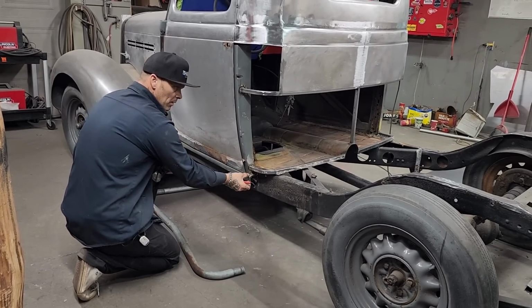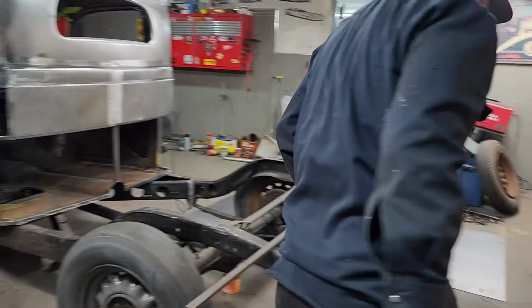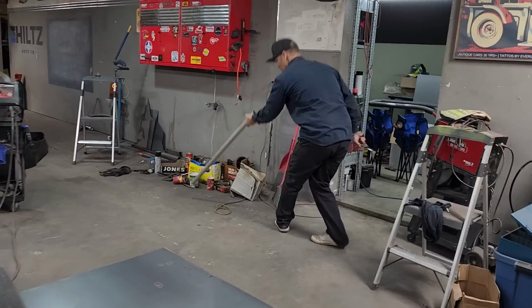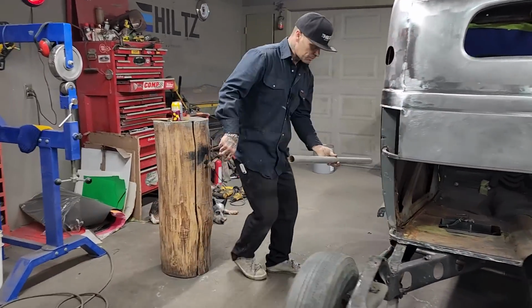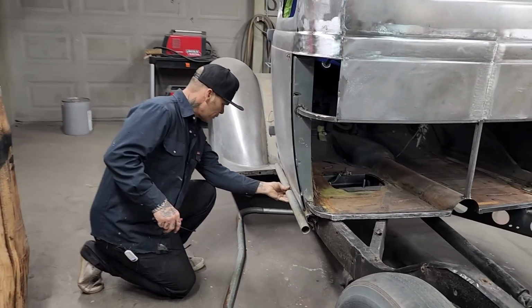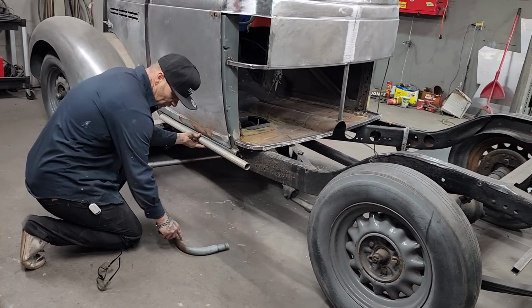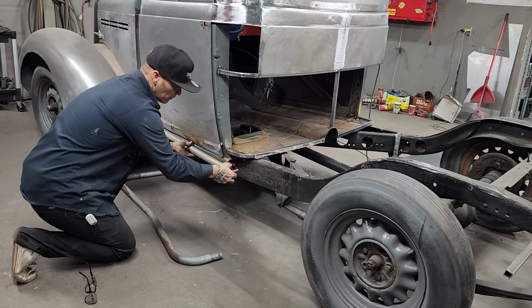I'm thinking of making this sill out of either, I think this is 1¼ inches maybe. Not sure what size this is, but I'm probably going to make the new sill out of exhaust pipe underneath here. I'll make that there. I'll bend that by hitting it on the ground. Then I have this shape right here that I can weld on the end of it